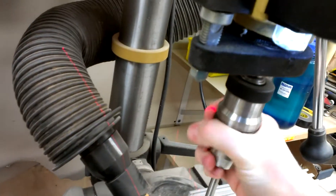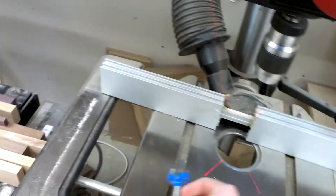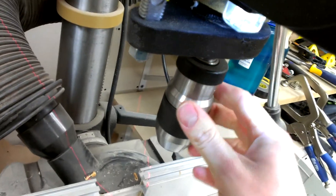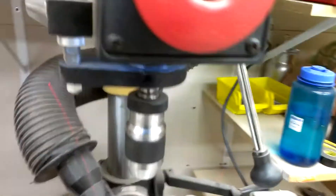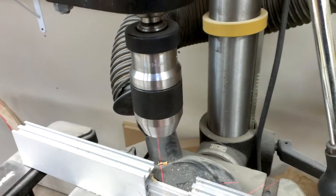The chuck is a keyless chuck. The keyless chuck would not stay on the spindle when I first got it. I had to take some sandpaper and rough up the tapered spindle. So that was kind of a pain when I first got it. I almost destroyed a project because it popped loose and came down.